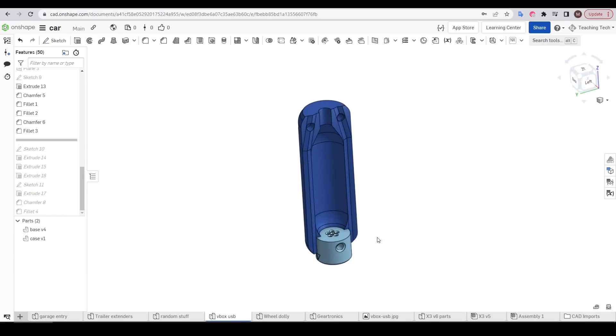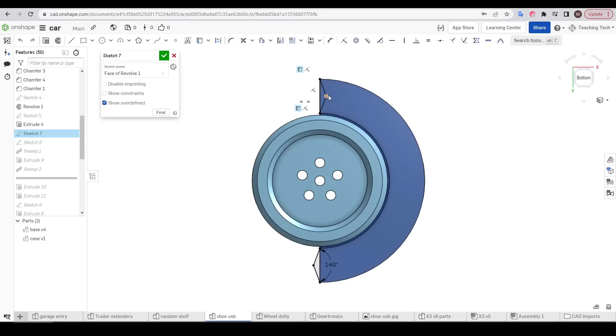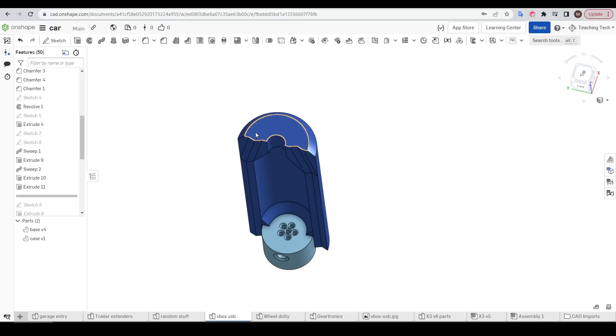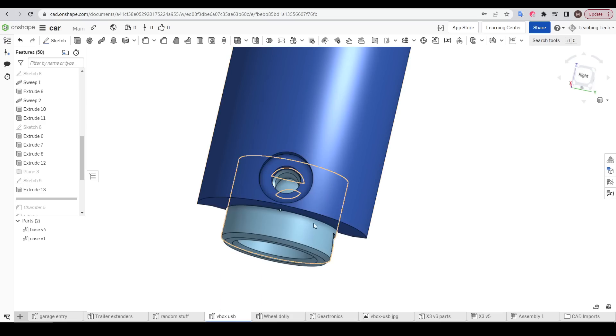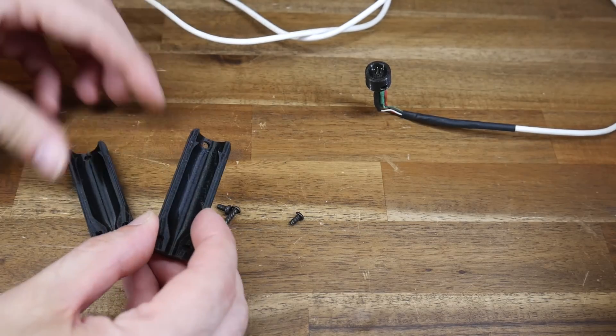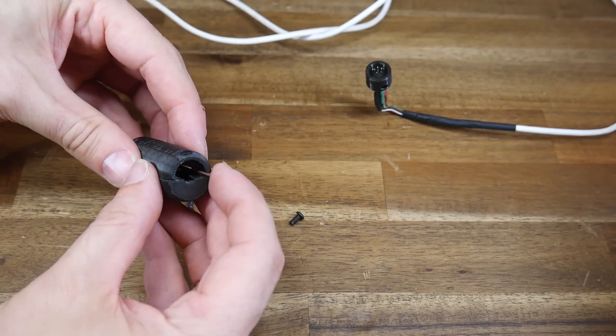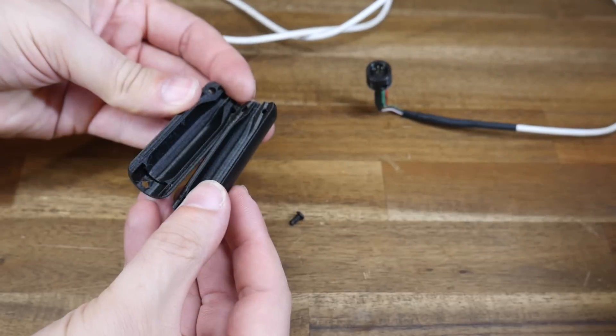After taking some measurements, it was time to design the rest of the housing. I decided on two symmetrical halves, created a simple sketch and revolved it 180 degrees. Rather than have the two halves meet flush, I sketched out two triangles — one pointing inwards and one pointing outwards — and used these with some guide profiles to sweep some geometry, creating a protrusion on one side and a recess on the other. The top got holes for bolts: one small enough to cut thread and one with clearance for the bolt and head. I added the same type of hole and clearance at the bottom to interface with the initial section, then added fillets and chamfers to streamline the part. Here are the two halves and the required M3 bolts — two of the same part printed, but they slot together nicely because they were made symmetrical.